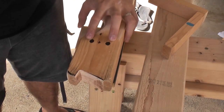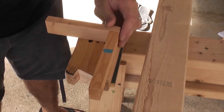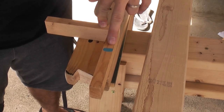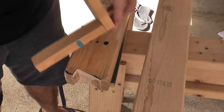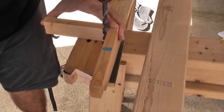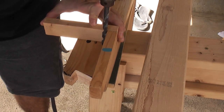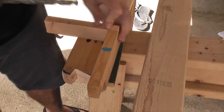Here I have the stock and this is where I'm going to be drilling my first two holes. Now to make sure that my holes are lined up, I'm just going to be using this — it's just a square made from two pieces of 1 by 2. That way if I line up along the 1 by 2s as I'm drilling, this hole will go straight through as opposed to going crooked. So here we go.